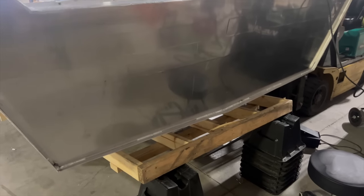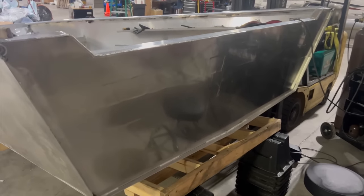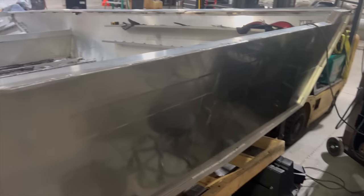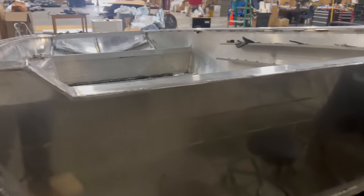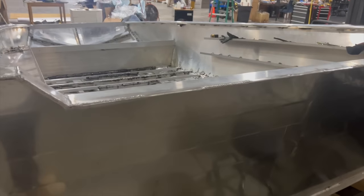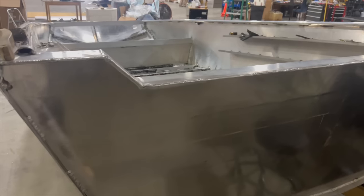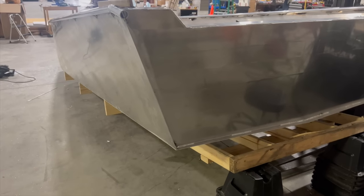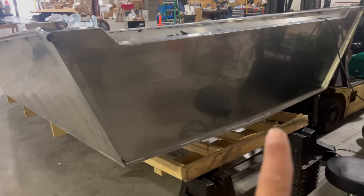Sort of lucky and unlucky. I've got all the rest of this week, it's Tuesday, to weld. So I'm going to get the transom fully welded on the outside, probably do a little bit of front welding on the bow where it's easy to get at. I've got the boat up right now as the train goes by. So get this transom welded, and then hopefully tomorrow we'll flip it. And then I'm just going to hammer down as much as I can and weld the outside seams and the middle seam.